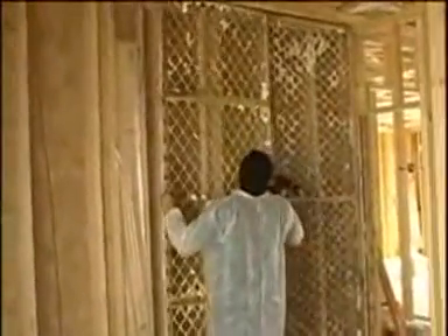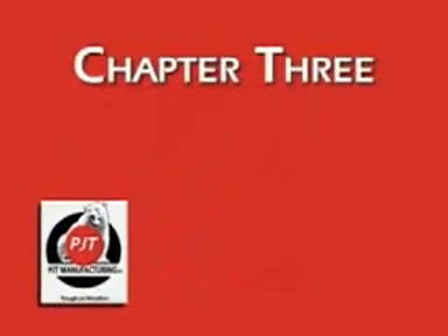Step 5. After the poly has been properly stapled to the walls, it's time to start attaching the panels with two screws in the middle and one at the top. Now that your machine is preheated, test the foam on the floor. Watch how the foam reacts — it should grow and then, very slightly, set back. Now we're ready to start foaming.